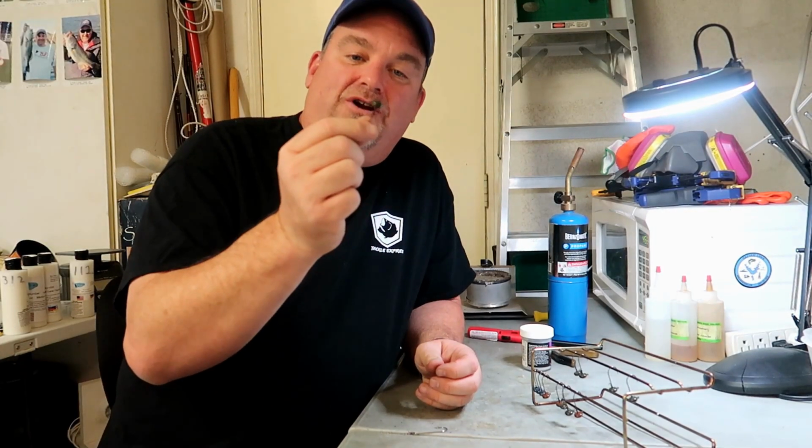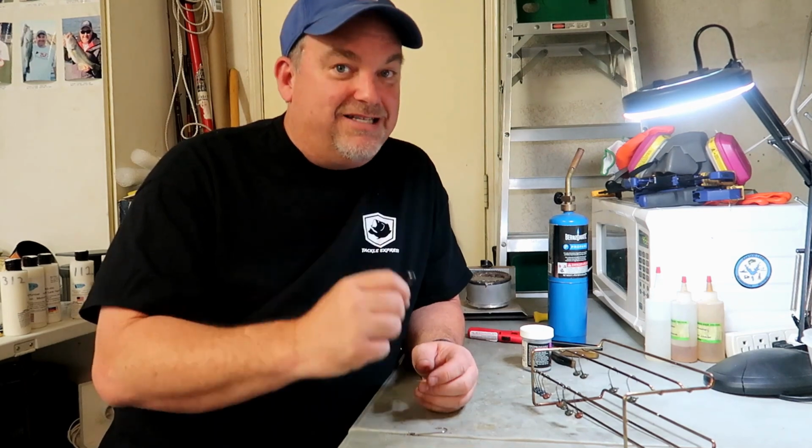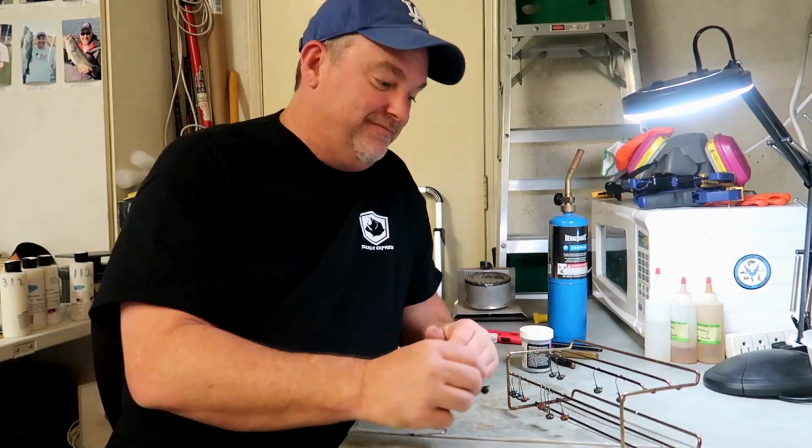All right, once you got these things painted and you've cleared out the eyes so that you know that they're not going to be clogged up, it's time to go ahead and put them into the toaster oven. Now I cook these at 350 degrees for about 25 minutes, and what that does is it takes your paint and it's going to make it really hard so it won't chip off when it hits the rocks. So the next step for these guys, into the oven.